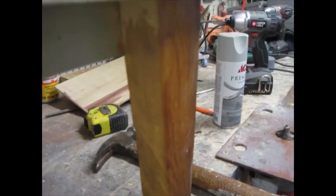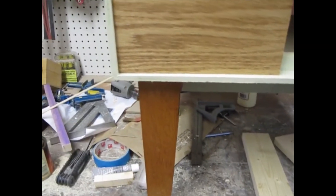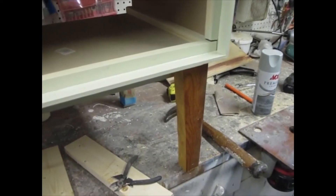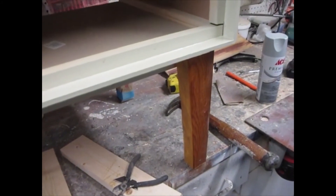I just put a coat of stain on the part of the legs where the wood was exposed from cutting it. I didn't do a very good job up there — let me get that. I'm actually using a golden oak stain — not that it matters, I just happen to know because I've been working with this wood. It's actually scrap wood. I needed to do this to match the old finish, so I'm not going to seal it with anything shiny like a shellac, but it is going to be the right color.